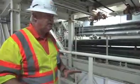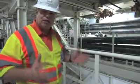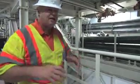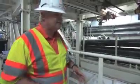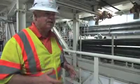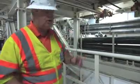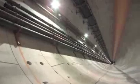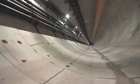Underneath Government Cut, we face a new strata, strata 6 and 7. The geological formation there is, again, hard rock with huge pockets of slurry, sluice. Because it's so wet, we have a dual mode on our tunnel boring machine. One, we deal through the solid rock and earth as we dig and bring the spoils out. The second mode is dealing with the water. Instead of a conveyor belt, we have this piping against the wall that takes all that wet spoils out.